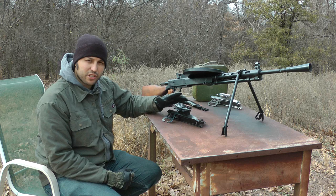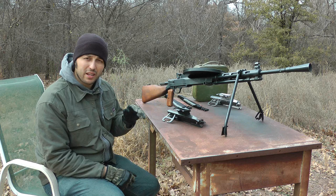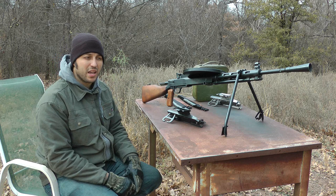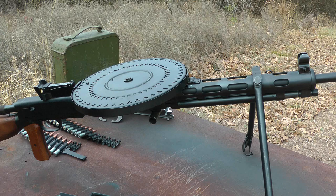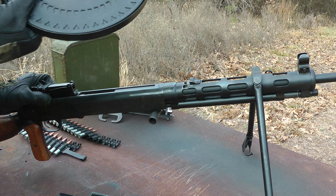One of the first things we'd like to show you is the differences in how the top cover is attached, and that a gun with a pan magazine can go right to our new top cover and back again with no issue, and also show you the difficulty involved in taking it on and off, and that it will also go on DP-28s, not just the DPM series. So I'm going to move in a little closer to the camera so you can see some details. What we have here is our post sample DPM with the pan mag on it, as all of you probably know. Pull back on the release on the rear sight base, lift the mag off, set it aside.